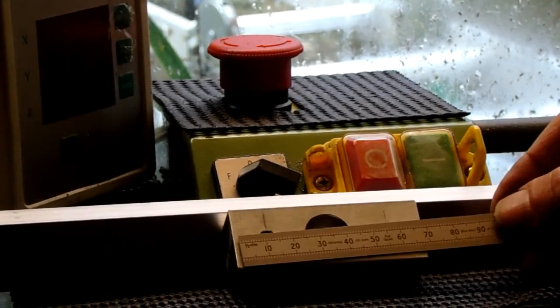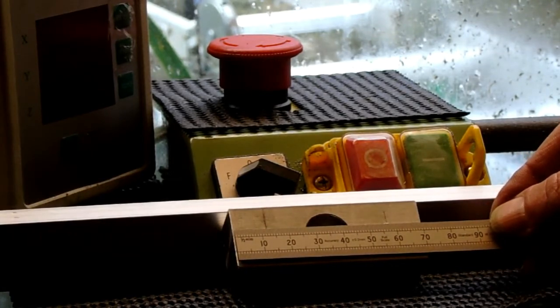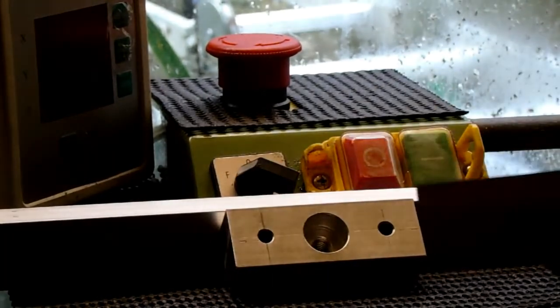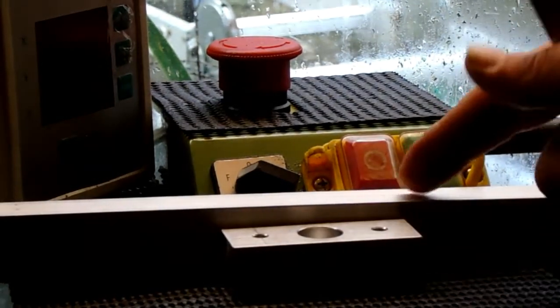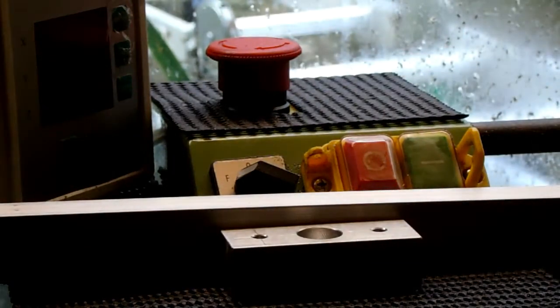The overall length isn't critical at all, but I like to make them smack on 70 mm, which is what it says, but basically the ends of this block are hanging in fresh air, but it's nice to have them machined off. So I've got a length of bar. First thing I'm going to do is cut up 20 pieces, 2 or 3 mil longer, 73 mil, something like that, and chop them up. And for that, I'm going to use my Evolution chop saw.